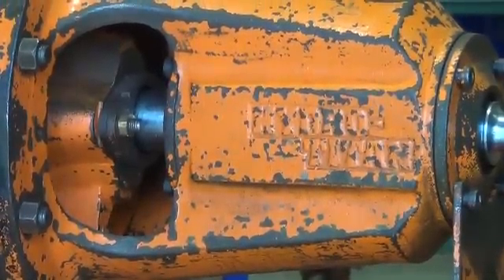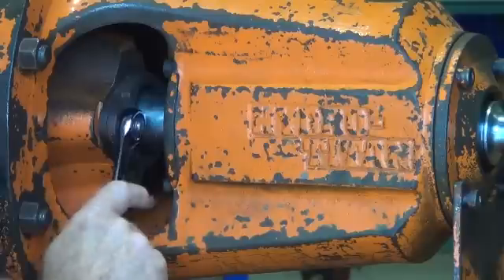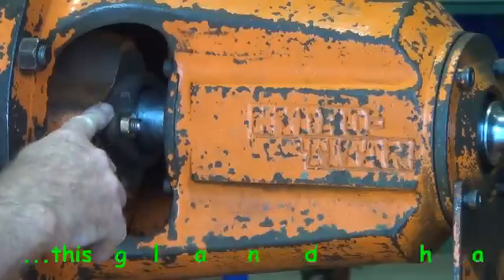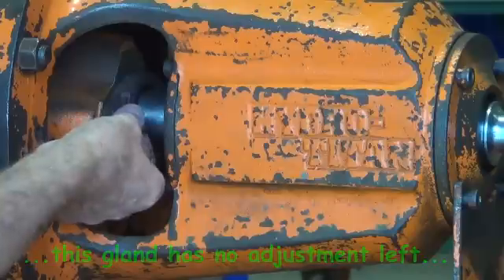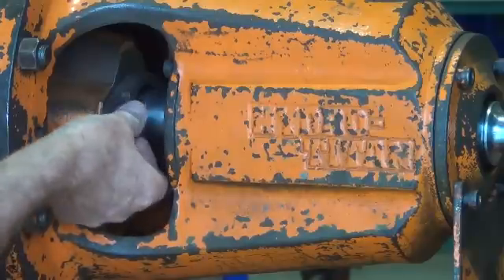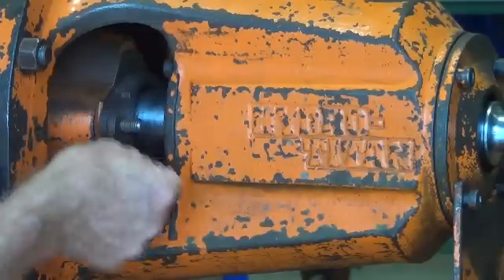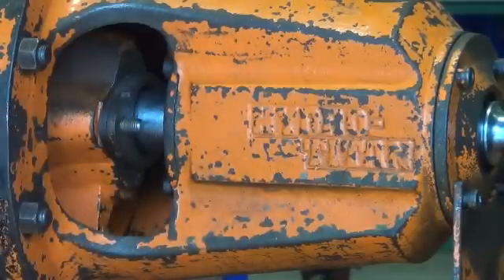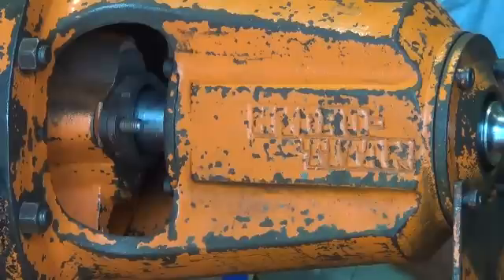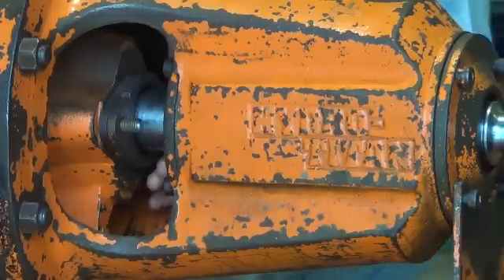Let's get started and we will just pull the gland out of this pump. Just undo the adjusting nuts there on the gland. What you can see about this gland is that it is hard up against the stuffing box, which means the packing has used up all its compressibility and flexibility and there is no more adjustment in it, which means that pump would probably leak or start to leak. Also it means the packing could be hard — it has lost all its lubrication — so the shaft turning could get very hot and the friction can burn grooves into the shaft. If you kept the pump running like that you may have to rework the shaft quite a bit to get it back into a suitable condition to allow the packing to stop leakage through the gland.